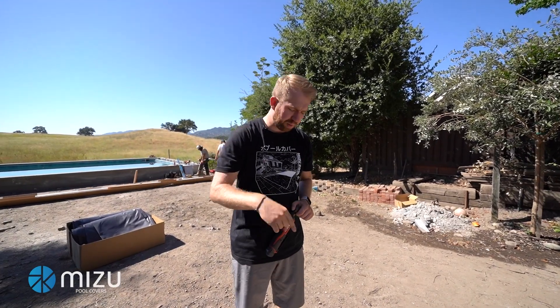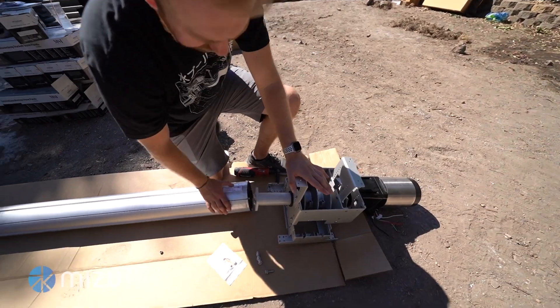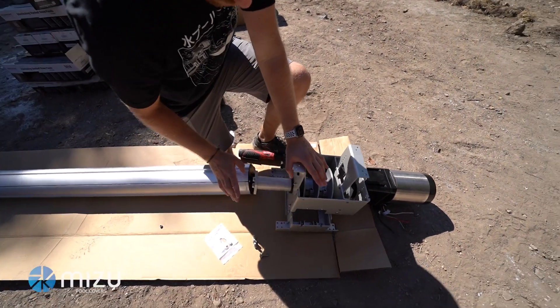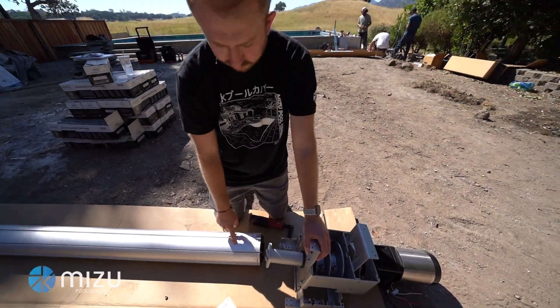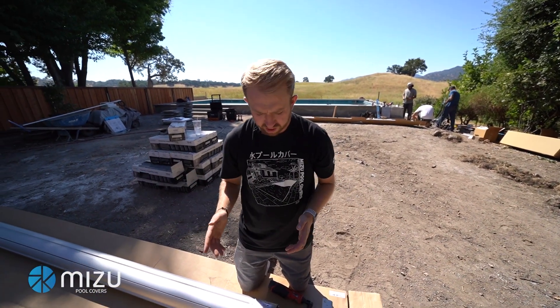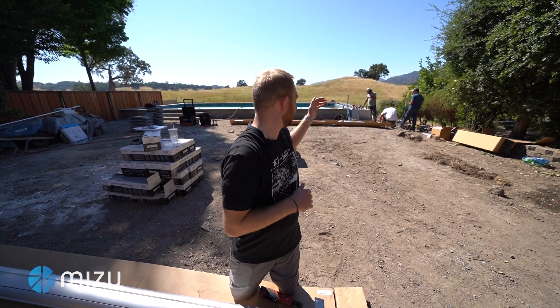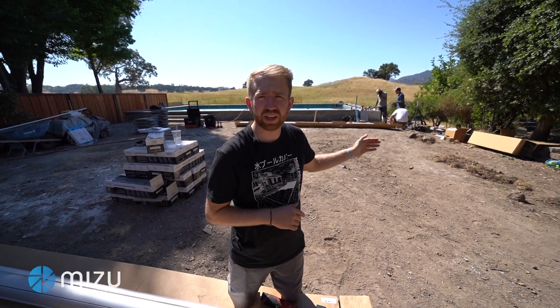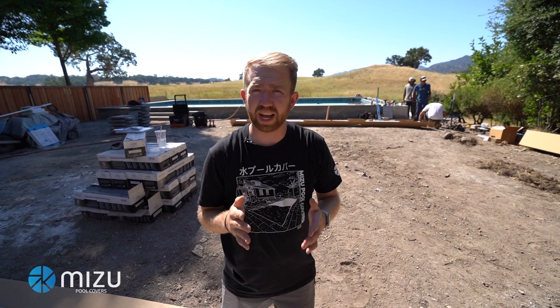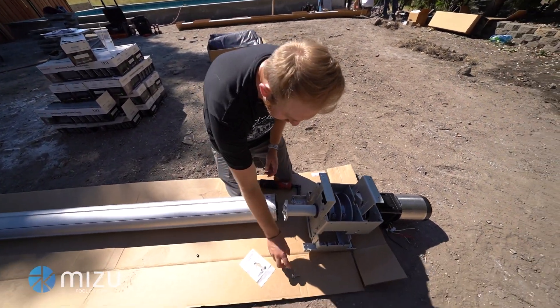We've attached the legs to the non-motor inside. Now we're going to attach the roll-up tube to the mechanism. Before we do that, we want to make sure this was ordered to the correct size. If it was a stock tube, you'll want to cut it down to length. If it wasn't ordered to size, measure your guide space from encapsulation to encapsulation and cut it three inches under that guide space. This one was ordered to length, so we can go ahead and attach it.